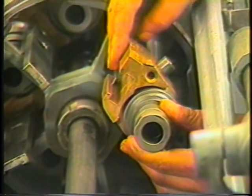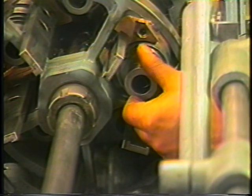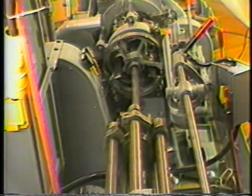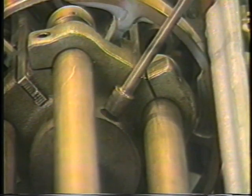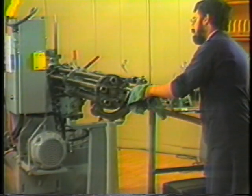Insert the feed tube assembly into its corresponding spindle. Align the feed slide with the slide rail and push it forward. Pull the feed slide detent, lift the feed slide latch, and slide the feed tube forward while aligning the key in the feed tube with the keyway in the inner spindle. Release the feed slide latch. Repeat this procedure for the remaining four feed tubes. Be sure the feed tube position numbers match the slide rail and chuck slide position numbers. Once the feed tubes have been installed, push the stock carrier back into position. The ends of the rails on the left slide bracket should be flush with the ends of the inner carrier. With a 3/8 T wrench, tighten the 3/8 square head screw that retains the carrier. Stock the machine and check each spindle for proper collet tension.